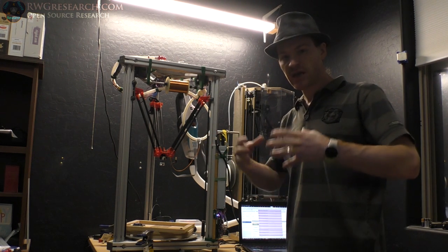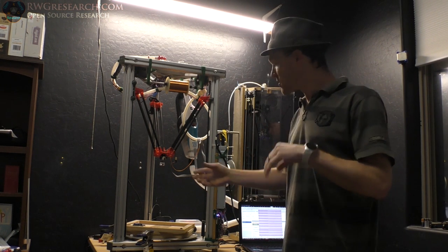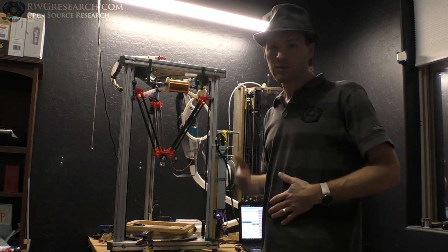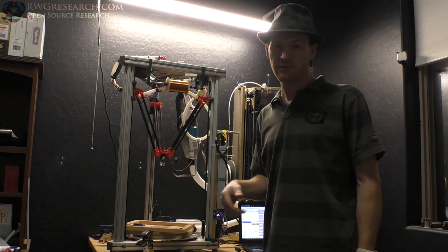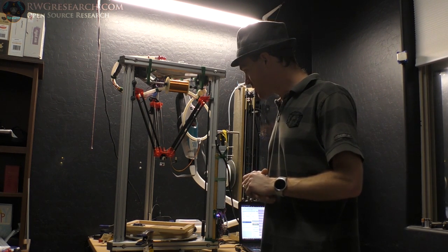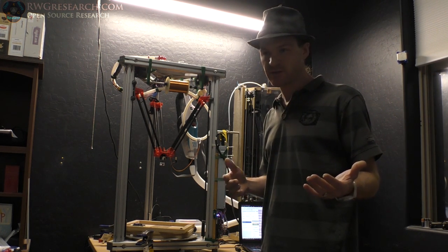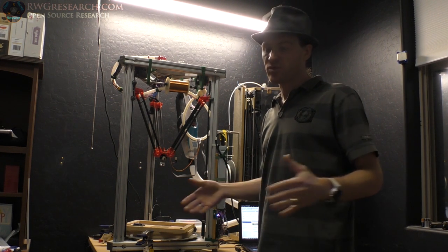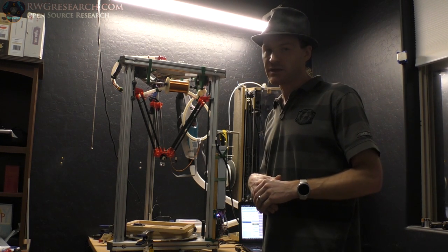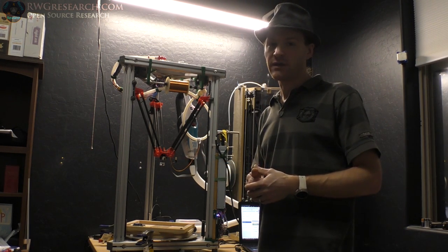One of the reasons I wanted to just take already made G-code and be able to edit that through a script and pop in the U values or V values, eventually this will be the V axis, is because really you can make a vinyl cutter out of this or any other sort of knife cutter. Or there's just lots of options here to play with. And so having that extra axis and figuring that out is good, but allowing you to make it with other G-code generators and just add in the extra command through a script seemed like a great idea. Otherwise, you know, we're going to have to figure out a whole other platform. It's a lot of different work, and it'll be specific for, like, winding coils, or it'll be specific for cutting vinyl or something like that.